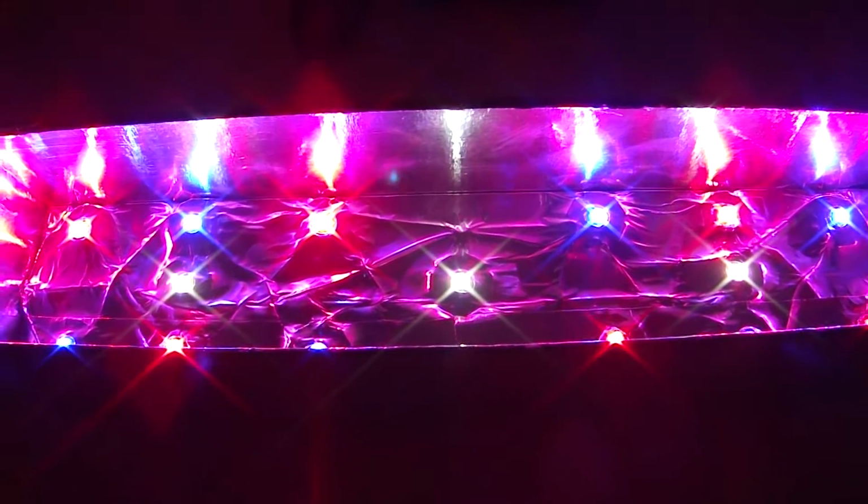But going back into that, plasma light, no matter whether it's sulfur plasma or metal halide plasma or ceramic metal halide plasma, which is actually where we see it going. We're not going into that at all, but with plasma, it's predominantly blue and green and yellow, and the red tapers off. You might get a few spikes here and there, and then they add LEDs to compensate for it.